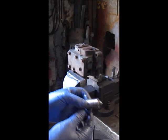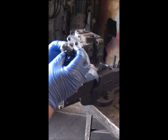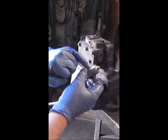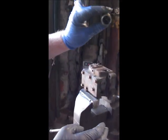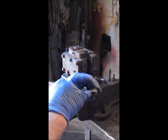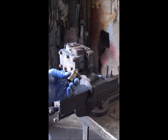The oil can get from that side to the inside through this relief passage. Here's one I've already prepared that's been modified — you can see the cuts. They must not go anywhere near the central cone and must extend about halfway up the side so that they're through to the inside — in other words, to perforate it. The Power Major had a ring of holes drilled through here at the base, which is not possible to do because this is hardened steel.